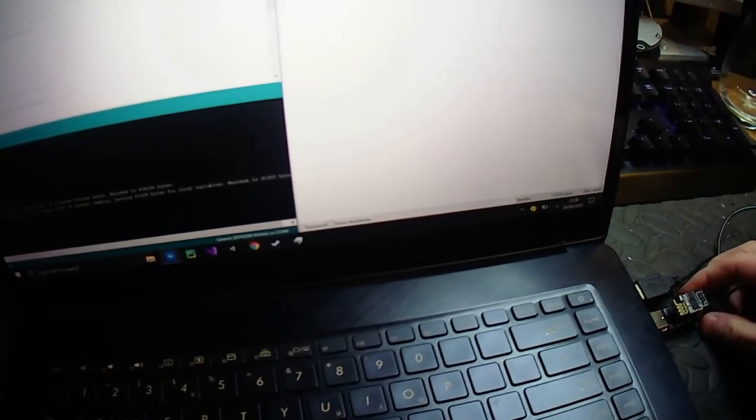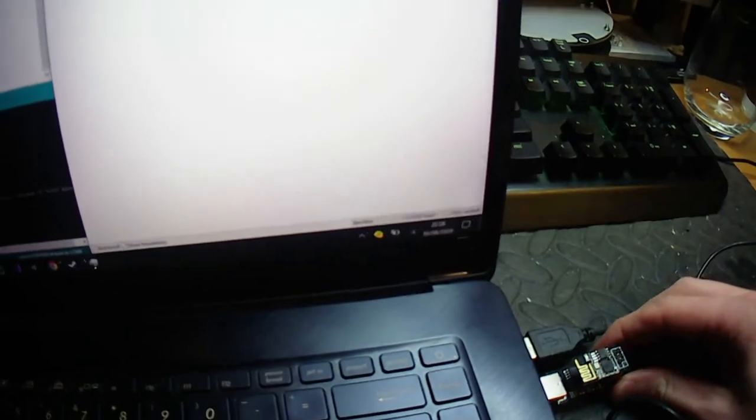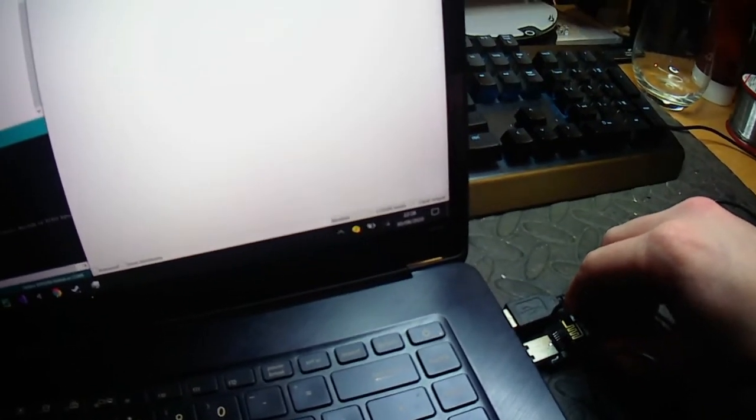So now we've wired it all up and we've got the simple button on the side. We can upload this script — I'm doing a blink script which I've edited. It's now just going to print the line 'hello from ESP' into the serial monitor. Currently it's not printing anything because we haven't uploaded the script. All we've got to do is hold the button when we plug it in for about one and a half to two seconds.